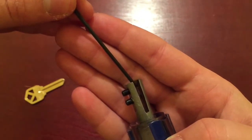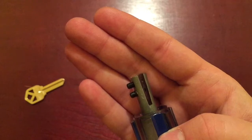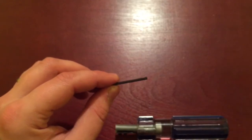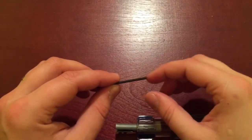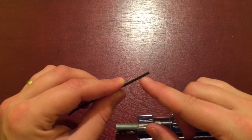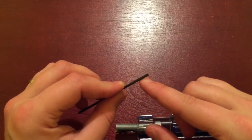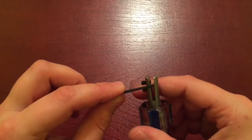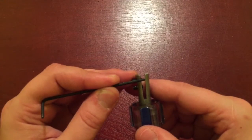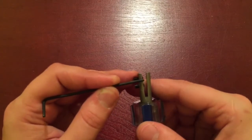As you can see, when I was drilling, I drilled in further than you would think you need to, and I'll explain why. When you're using the tap, it doesn't start making thread from the tip — it starts to cut the metal about four or five threads in. So if I would have stopped earlier, the tap wouldn't have been able to go all the way. That's why I made the space so you could go just a little bit further, and I was able to thread both those holes.